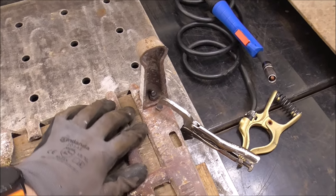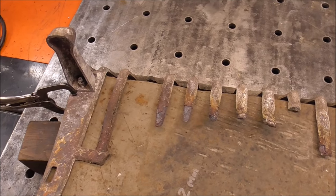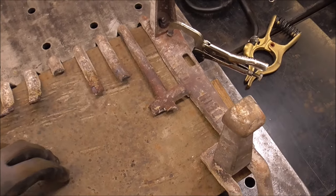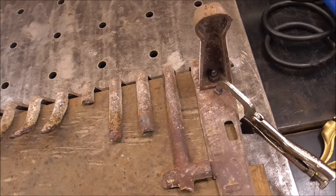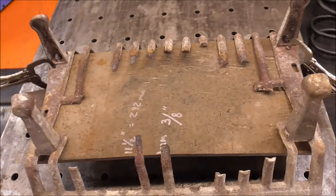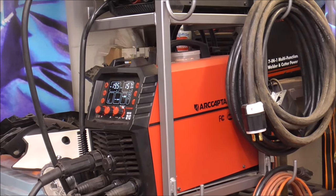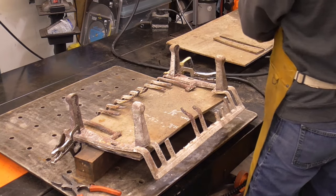Best practices would have you clean this down to bright and shiny metal, super clean, and all that. But look what we're working on — you have to factor in your time. Is it really going to make a difference if I grind this all the way down, when this is already pretty weak cast iron and a couple welds might end up cracking anyway? It's going to be absolutely fine. If it was something critical, yeah, always clean your metal down to bright and shiny. But this will work just fine. One other thing I love about that machine — listen — you don't hear a fan running. The fan only turns on when it's needed, which is super awesome in the shop.